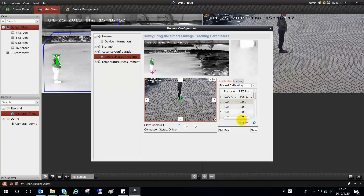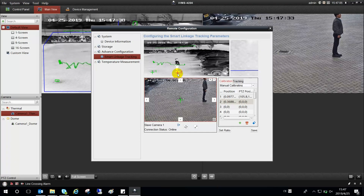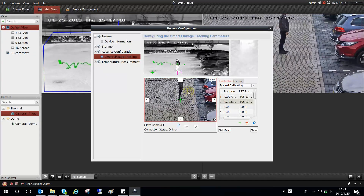Move the cursor to choose the second coordinate pair and click the green cross to add the second calibration point. Drag the point in the thermal view. Click the 3D positioning to enable the auto tracking and click in the optical view to ensure the center is exactly overlaid on the thermal corresponding coordinate. Click the 3D positioning to save the second point. Do the same steps for the next points.